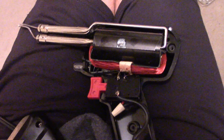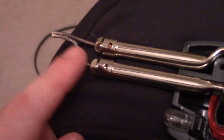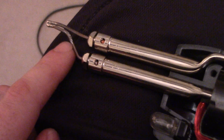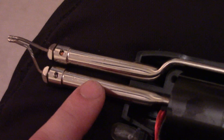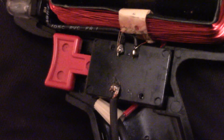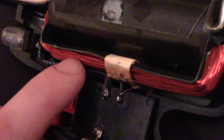What I neglected to mention is why the tip heats up so rapidly. The tip — which is about 12 to 16 gauge, I make my own tips so I can't remember the exact gauge — is of a much higher resistance than the nickel-plated copper tubing of the secondary. So the tip heats up much quicker than the rest of the secondary, which is what enables you to solder. Also, the two taps on the dual momentary switch correspond to two taps on the primary winding, which induces either the 100 or 140 watt heat rating.